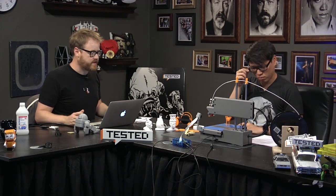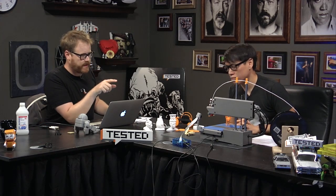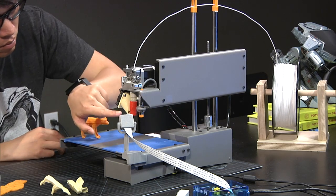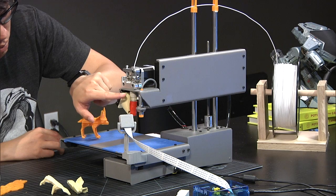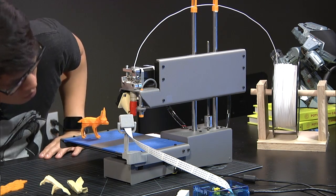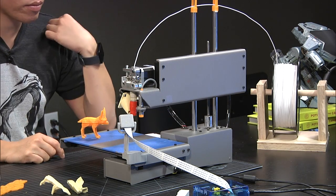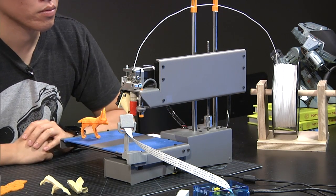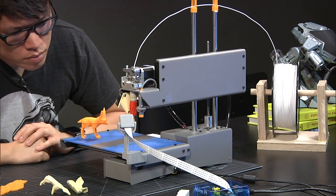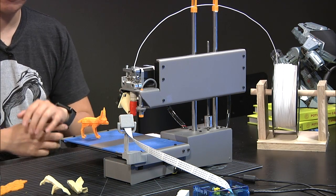The other thing that I found is that probably when we were assembling the kit, we did a bad job of getting the hot end, that tan and orange thing, in. It's only held into the extruder block with friction. So there's not a screw that goes through it. There's not like a lip or anything that it latches into when you cinch it down. It just goes in there, and then you tighten those 3 or 4 bolts on the front of the extruder, and they pinch it in place with friction.